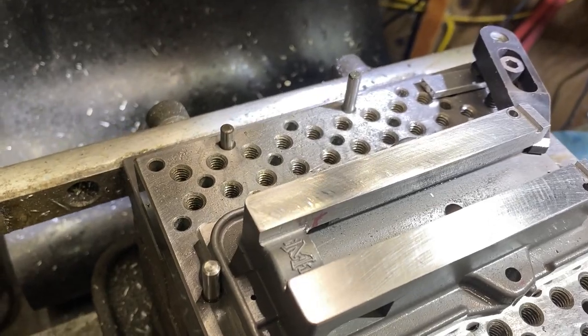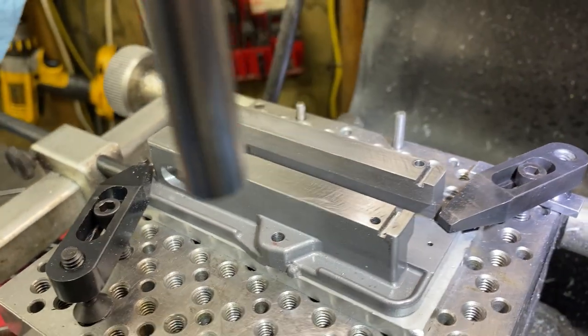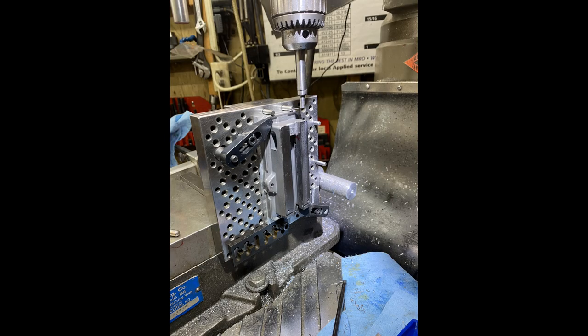Here I've turned the vice back over on the pallet and all the machining is done — just completed the slots for the fixed jaw keyway there. It's ready to move on. In this photo I've now turned the vice vertical. I'm on center since the bottom of the pallet has a key. It was very simple just to use the edge finder to find the edge of the bed, the face of the bed, and then move over so that I could drill and ream the hole for the screw — a real simple setup. Added another stop block underneath it just to make sure things wouldn't move.